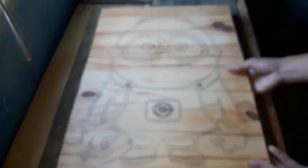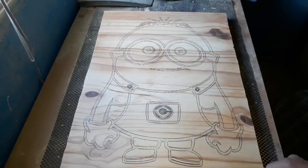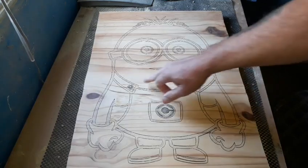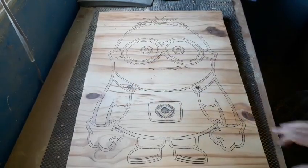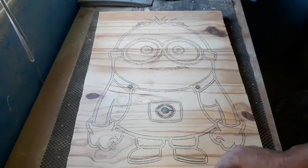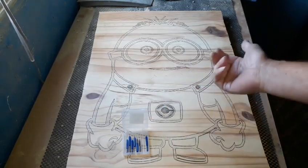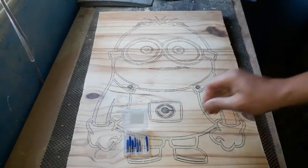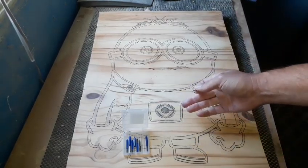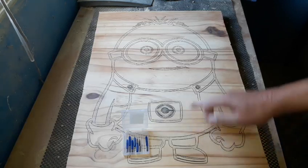There's a little G there — I don't quite understand what that's for, but there it is. If you find a template you're happy with, do a little bit of research because sometimes the template isn't quite right. I've also added some little crosses for cross-stitching those buttons on, instead of just routing them out flush. For the line work, I'm going to go with my CNC bits — I use these all the time. They come in different degrees: 15, 10, 20, and 30. We're going for a 15 today because we want a nice straight-down cut.